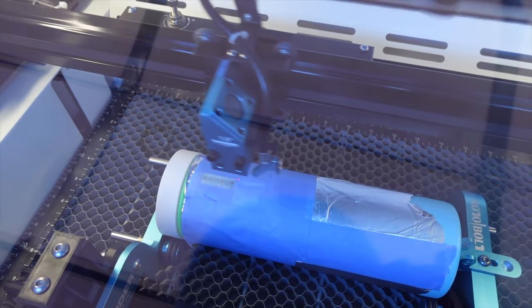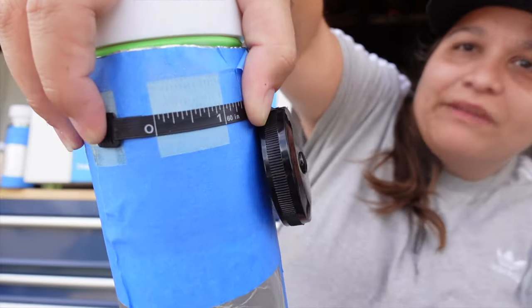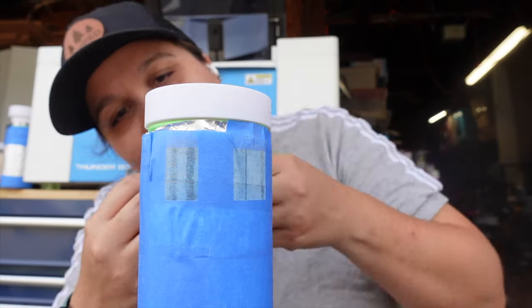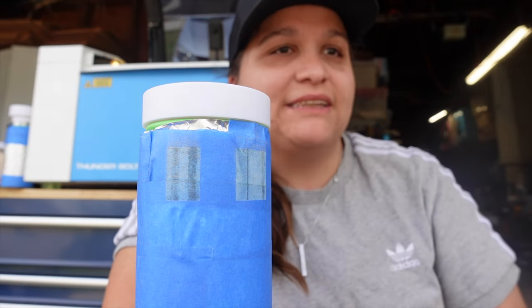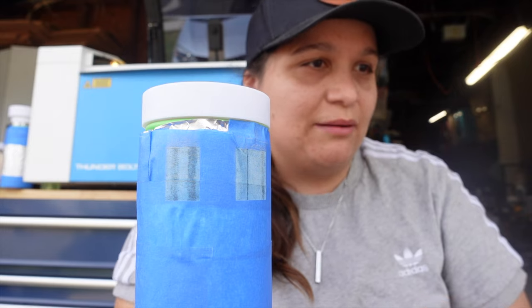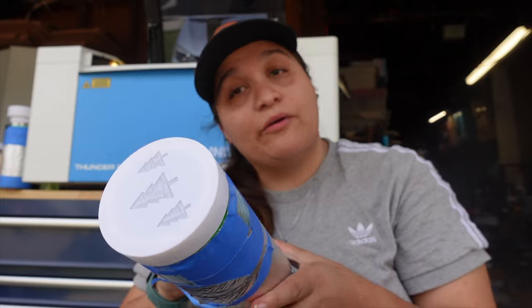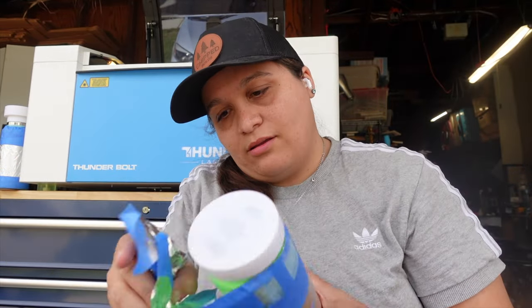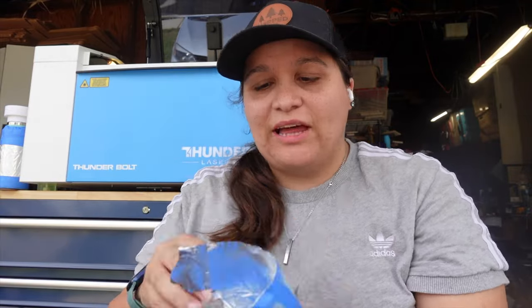But the nice thing is once you've figured out the steps for that size, that should work on every cup that is that size — you don't have to do it with each individual cup. That result is like pretty perfect — look at that. The height looks good as well. So for these Simple Modern 20-ounce tumblers with my 3D printed adapter, the steps per rotation is 4600. You can use that number at your own risk, but you definitely need to be doing your own testing. Let's get this tape and foil off so we can do our design. No markings went through the foil, which is pretty awesome — so that's a fun little rotary hack. You can also use foil tape that you can find at Home Depot in the air conditioning section.